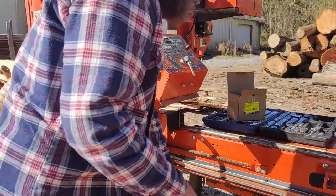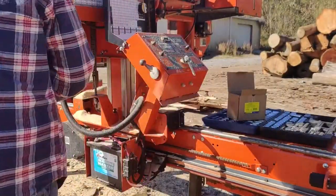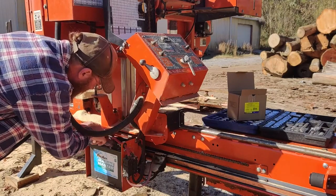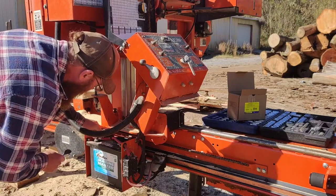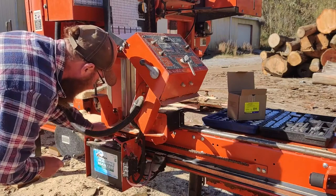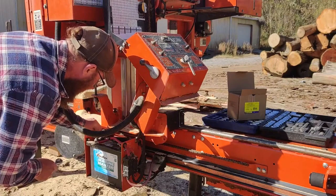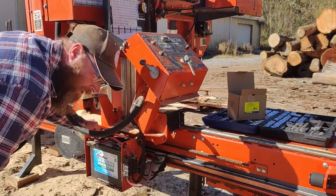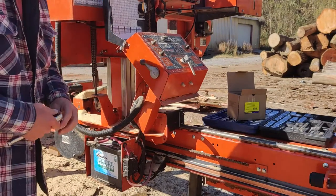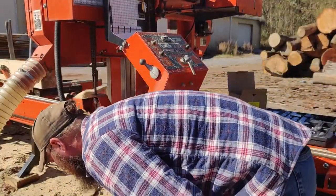Of course, it's not the socket that I thought it was. Should know by now doing this. I'm just going to take the hot lead off of here. Make sure it's not touching. Put our nut and washer back on. Leave that on there, so that's not touching. There should be no juice whatsoever flowing through our panel. Set this out of the way.